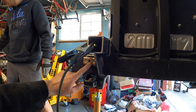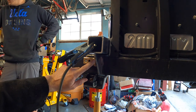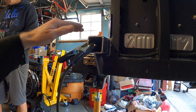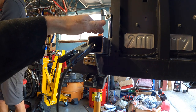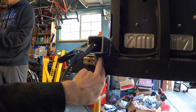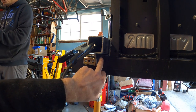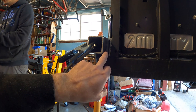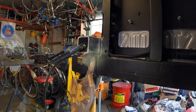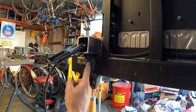Here's the fun part — I actually get to weld. How we have it set up is with a magnetic tool helping keep the rear gusset in place. We're going to tack the gusset onto the swing arm and onto the receiver first, because we noticed we could easily get it tilted the wrong way. By first putting the rear gusset in square to both the swing arm and the receiver, that'll be a good starting point. I've got three tacks in and can now safely remove the magnet and start tacking in other places.